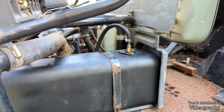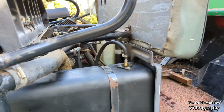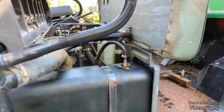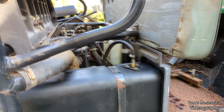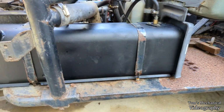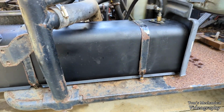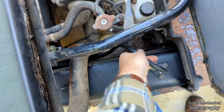So, I mean, I don't think that's going to end up being the fuel restriction that limits this engine, whatever this is, especially considering it's going through 1/4 inch fuel line and all of that. So whatever surface area that's got to pull fuel from the bottom of the tank is good. And honestly, the closer it gets to the bottom without reaching whatever critical threshold will starve the system of fuel at full throttle is good, because that means we're getting every last ounce out of this tank and drying it down far enough, and it's not just developing a crust of water on the bottom to rot it. But anywho, that's in. It's all piped up.